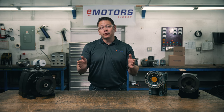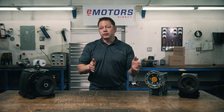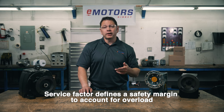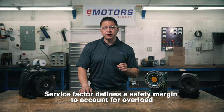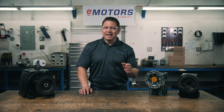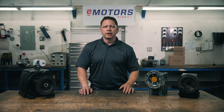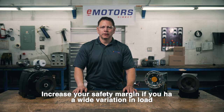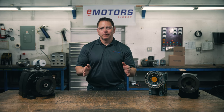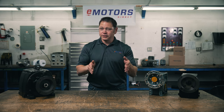Let's consider how many hours per day the gearbox is running, which will inform our service factor. Service factor defines a safety margin to account for overload. For example, a service factor of 1.0 means the gearbox has no safety margin and would easily fail if overloaded. A gear reducer with a service factor of 2.0 could handle double the required application horsepower and is highly oversized for the task. The gearbox's service factor directly impacts the durability and resistance to pitting and bending fatigue of the gear teeth. Increase your safety margin if you have a wide variation in load. Also consider how many hours per day your motors will run — the more hours your motor is running, the more you'll want to oversize your gearbox to allow for sufficient cooling.